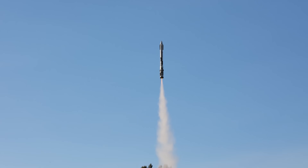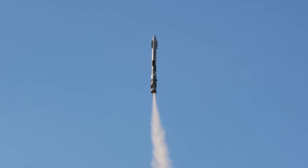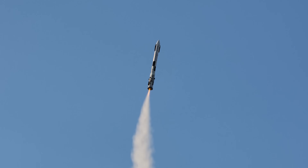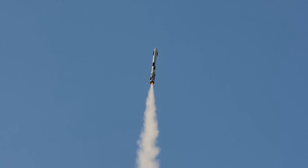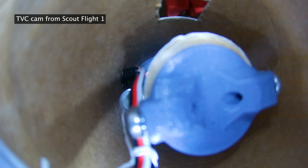Which is why you see just a little bit of wiggle on ascent, but we're also totally locked in on attitude. Flight 2 looked really nice in pitch and yaw. We did have a pretty solid overshoot when we hit that pitch-over portion on ascent — I believe that was because of a jam in the TVC mount, and this may also have contributed to the motor ejection problems. The servo cables that run up the inside of the airframe can sometimes get in the way of a full actuation of the mount when there are two motors in there, which brings me to my next topic of motor ejection.